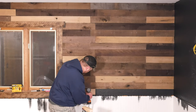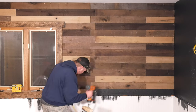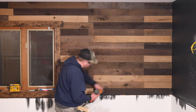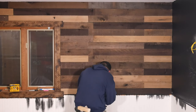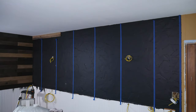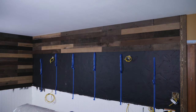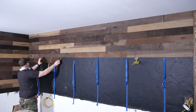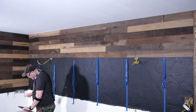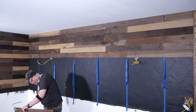The planks were a little too wide to fit perfectly into this bottom row, but after a quick pass through the table saw, they dropped right in place. That really is what most of woodworking comes down to — cutting just a little bit off to make it all fit. I'm using the same scribing technique here that I used to fit the planks around the window, scribing a pencil mark directly onto the plank. This mark will show me where to cut a small notch in the plank to pass the electrical wire through for the wall sconce lights.